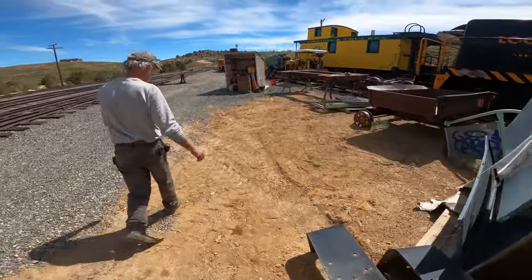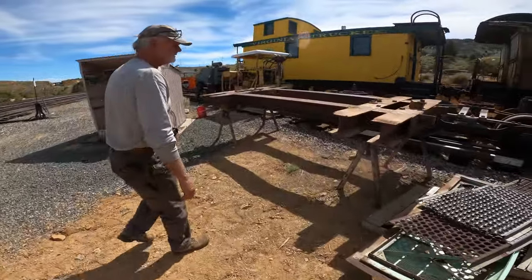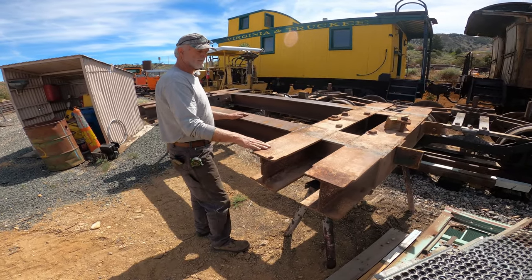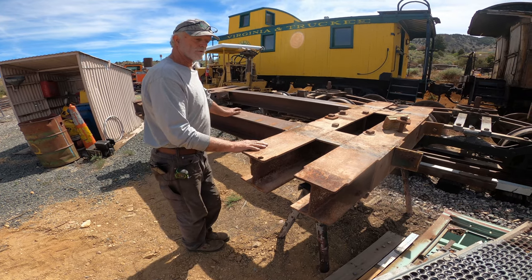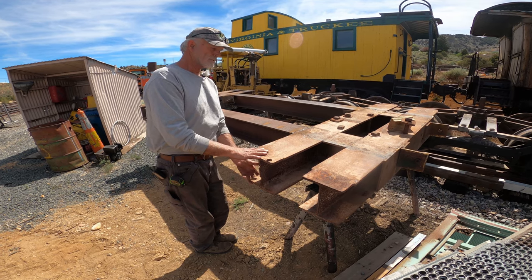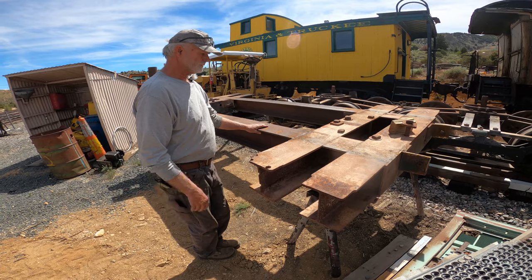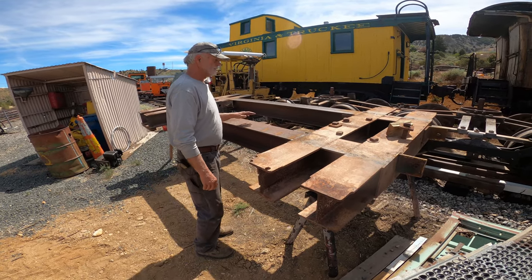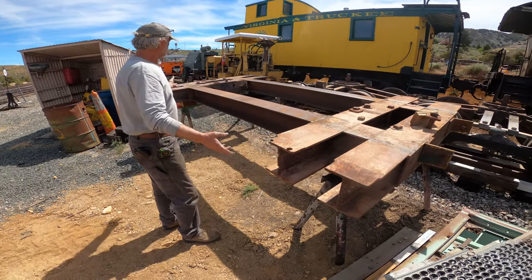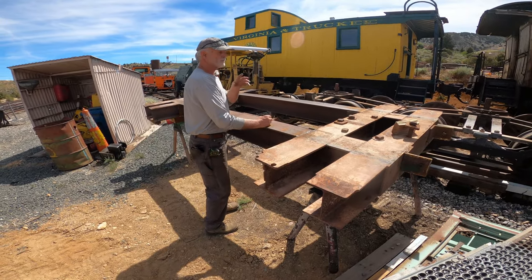We've taken everything apart on the tender. The 8-inch I-beams here were done by the railroad — probably the SP — early on, replacing the 8x8 timbers for the tender bolster side beams. I welded some of our old leftover tunnel beams, which are also 8-inch, for some of the center supports. We'll get the select lumber and mount the coupler, the front drawbar, the buff rear coupler, and the buffer plate.